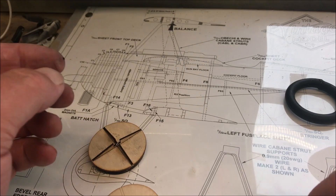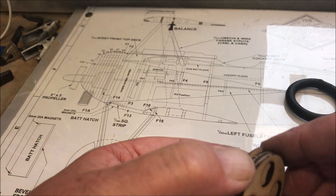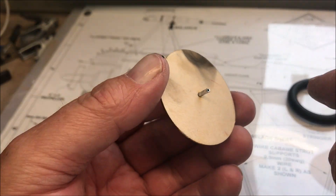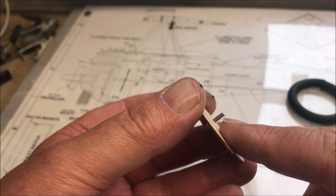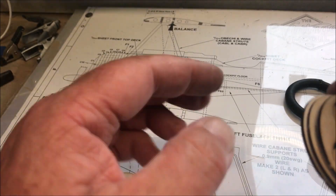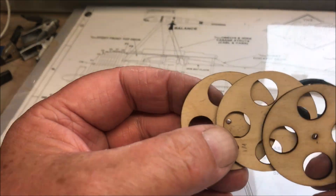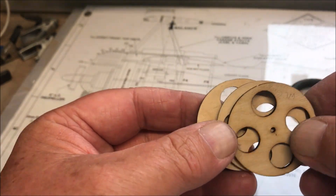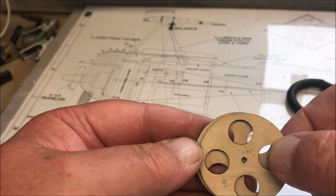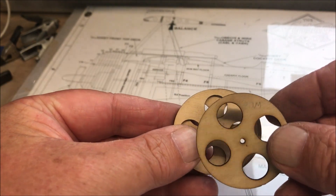To achieve that, there's some aluminium tube in the box. Cut two pieces at 9 millimeters long, and then you'll have these which are W1 — there are three W1s. Basically put them together like that, balancing them out a little bit.